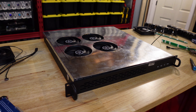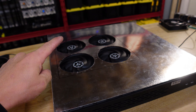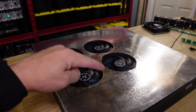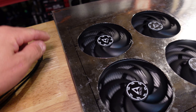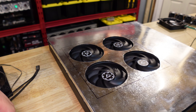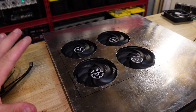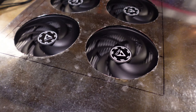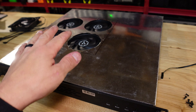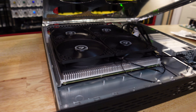The unit registered in the software and then shut down because it overheated. I cooled it off, got it running again, and a fault light came on. I went back into the miner and it said there was a fan error. The fans aren't spinning at full speed — fan 2 is registering over 3,000 RPM and fan 1 is around 200. You can still see the logo through the fan blades, so it's definitely not running fast enough.